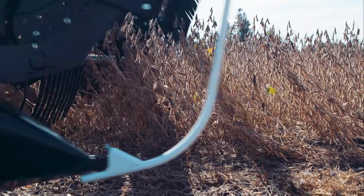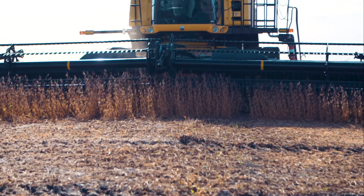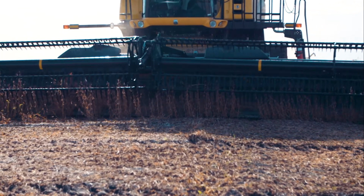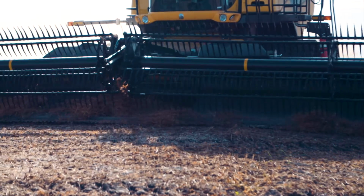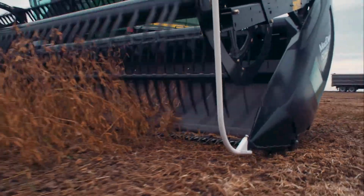The FD1 FlexDrapers utilize a hydraulically driven knife. Using hydraulics allows us to incorporate an efficient, safe relief into the system to stop the sickle in the event the sickle comes into contact with an uncuttable object. Often this results in little to no damage to the cutting components.